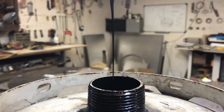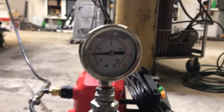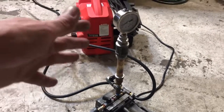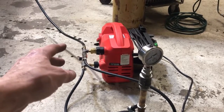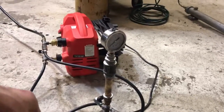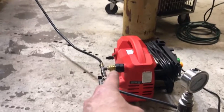That's barely coming out of there and we're at about 40 PSI, fellas. So there you go, Phil, Aaron. This demonstrates how we are able to produce the exact pressure and exact flow rate that we want without any pulsation involved using a three-piston positive displacement pump.